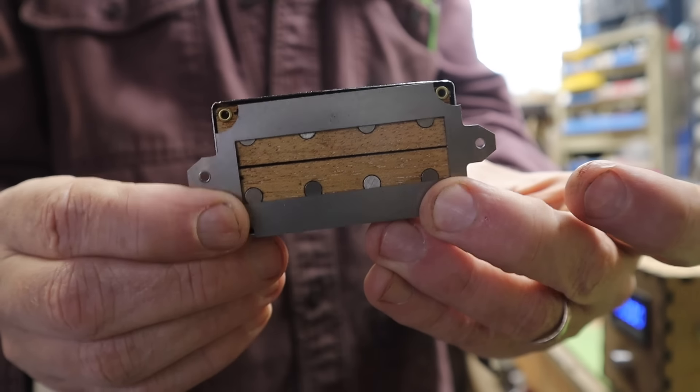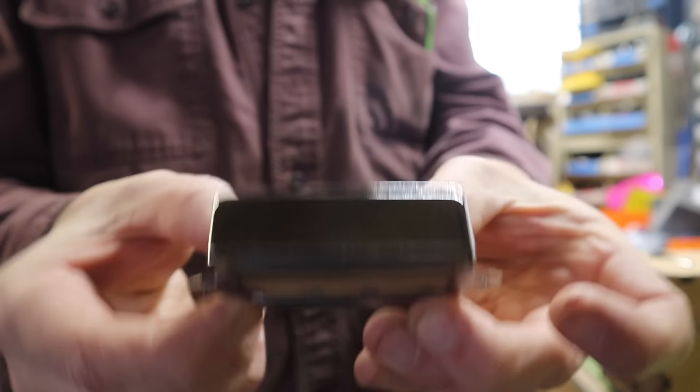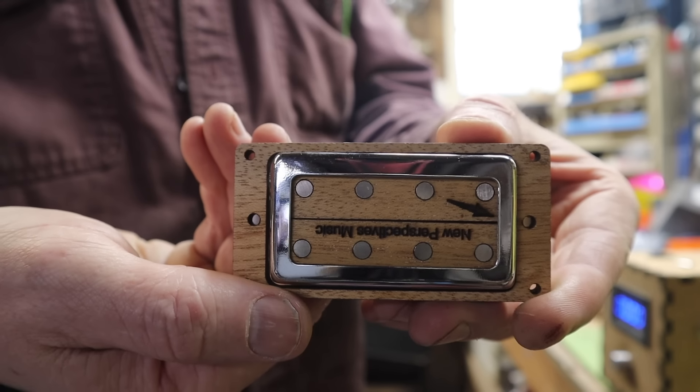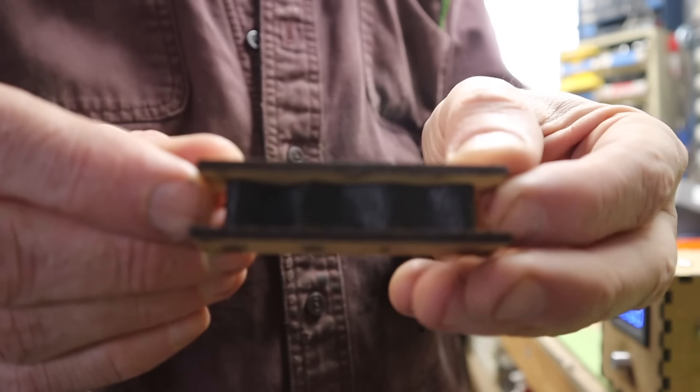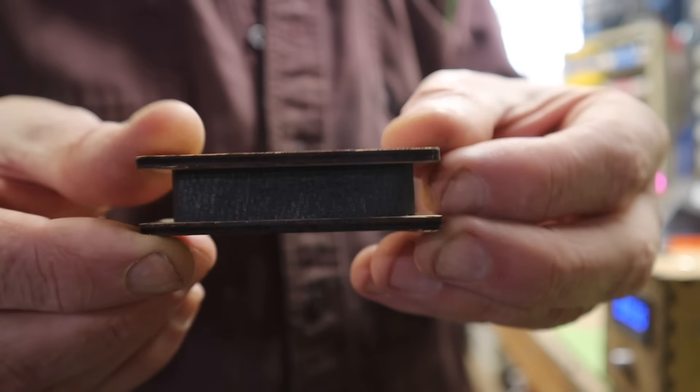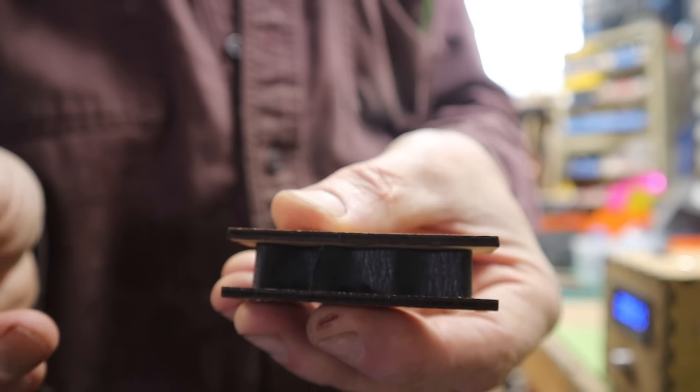Here's an example of ditching reclaimed to make a better product — I designed some base plates that I have cut by SendCutSend from metal that I can thread, and it makes the whole pickup easier to put together and thinner. I'm not messing around with wood that splits when screws go in. I also wrapped those Alnico 5 poles with some electrical tape and cloth electrical tape before winding.